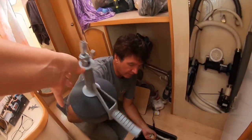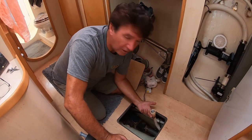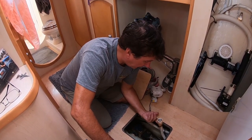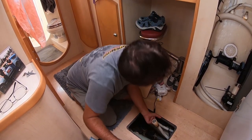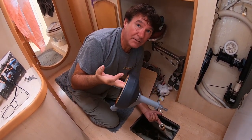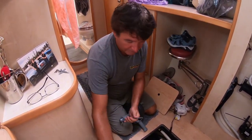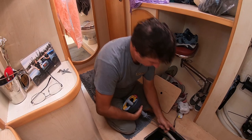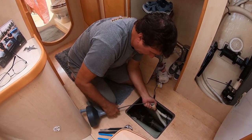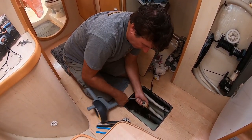Here's your weird tool. This hose is a very common hose for plumbing on a boat — common size, common type. It's so common that everybody here is out of stock. We went to three different places and nobody had it. So rather than leaving a hole in the side of the boat with nothing on it, we came up with plan B — we're going to try and snake it and see if we can get it cleared out enough that it'll pump water through it. It's a plumbing snake. The upside is we can use it for the scuppers that we're having issues with too.